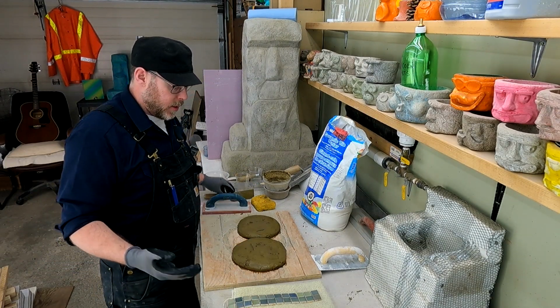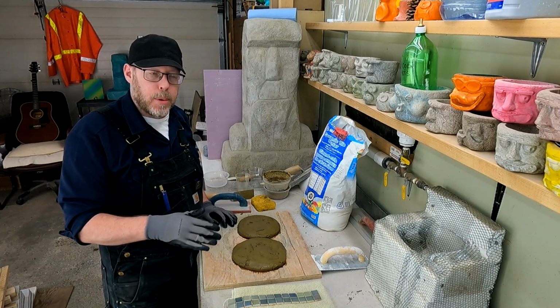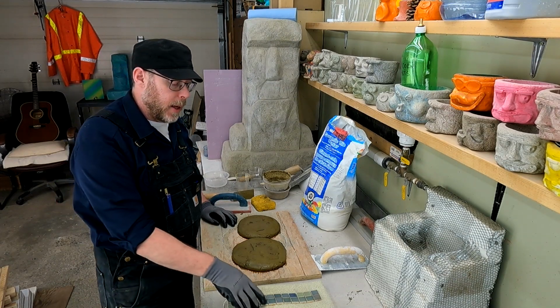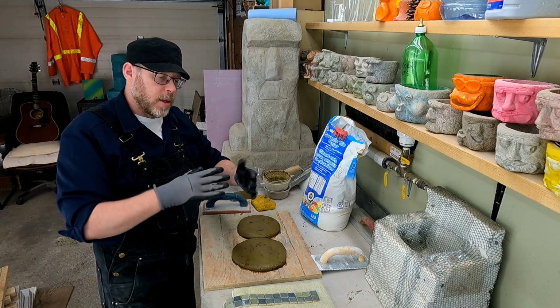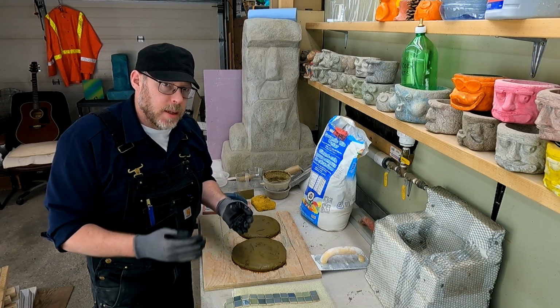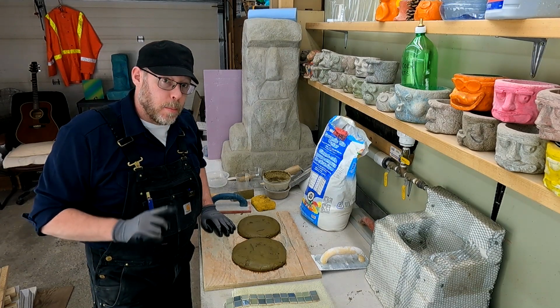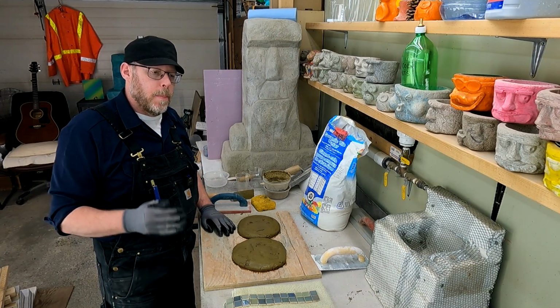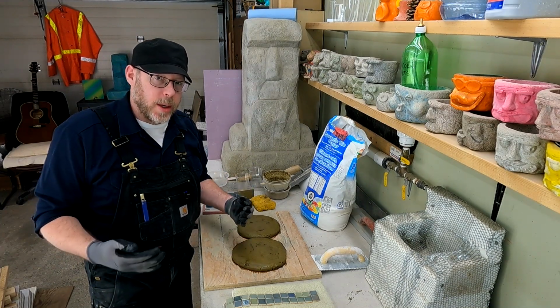There's a couple things to consider. I mean, one, ideally you'd like it to be flat, even level profile. That would be a big help. The thinset's very forgiving. There's a little bit of give in terms of its movement, but ideally when you see fabulous looking tile installations, they looked fabulous before the tiles went on. When you do a mud-based preparation that looks amazing, the tiles have no choice but to look great.